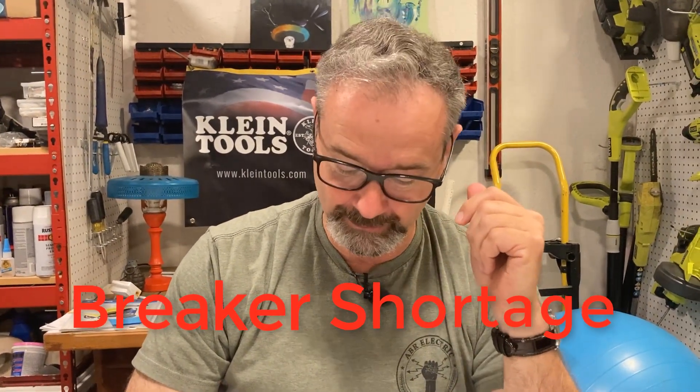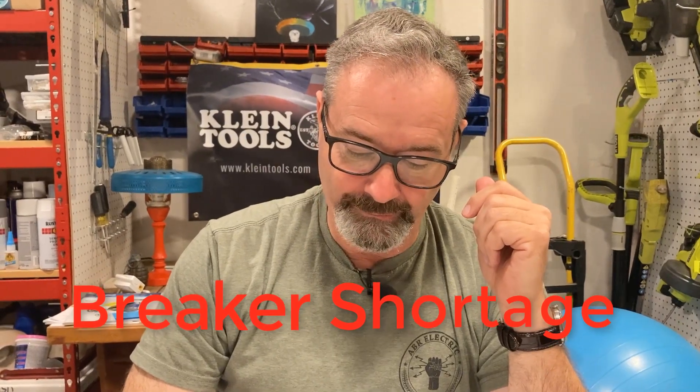Finally, you guys and your questions about Romex and conduit. One of the subscribers called me out — and thank you, because you're absolutely right about just stripping the Romex and running it through the outside pipe. Here's the scenario: by NEC code, whatever parts or materials you have have to be listed and approved for that application. That comment made me look it up. I went to Southwire, one of the Romex manufacturers, and looked at their specs on the individual conductors — the black, white, and bare copper inside the sheath.